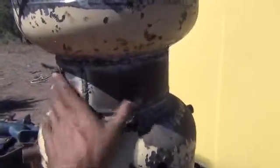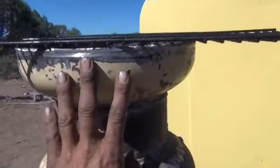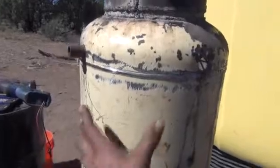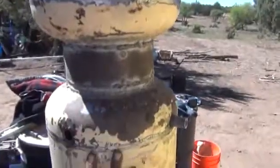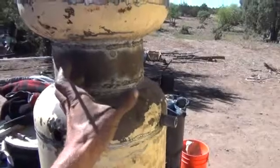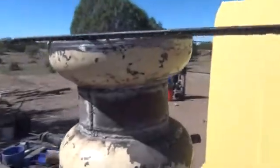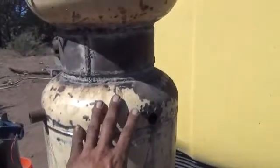I showed you in the last video that we had reinforced this. I'm just going to quickly chop down the screen now. The purpose of this final bell is that hopefully by the time material gets into this, most of it has become ash or is reducing down to an ash point. The gas we've produced — which is actually being produced from here upwards — this pyrolysis will be taking place here, producing gas that will be forced, due to pressure inside a sealed tank, up through the system. It will be reduced through a heavy concentration of finer-grade charcoal, then back through ash and out the screen and into our system. That will help refine the gas we're producing, clean it up, and hopefully produce a lot less tars in our design.